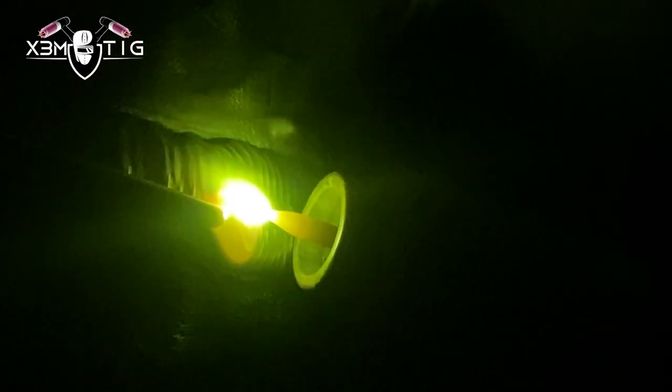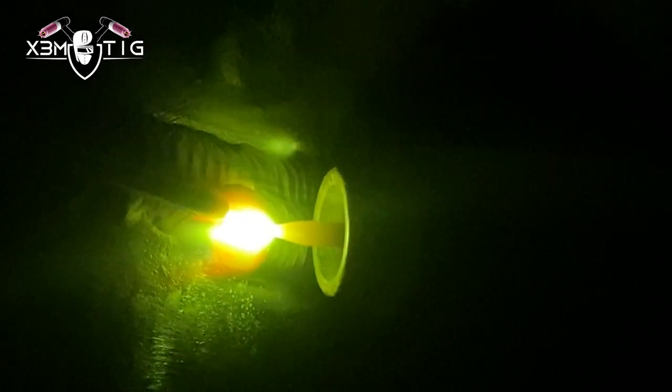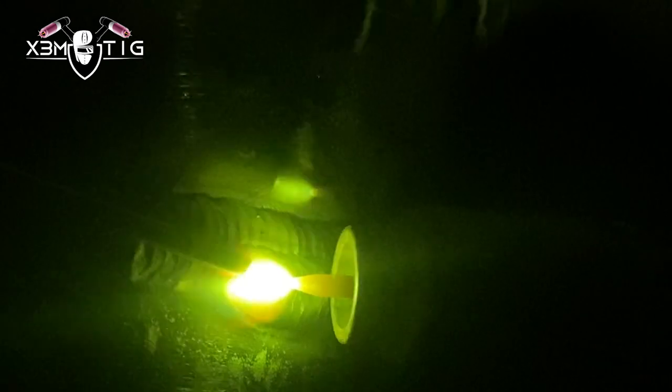Now starting on the second pass — going a little bit heavier on the fitting side. Try to be consistent with your steps and your weld bead width. At this point I'm really sweating a lot, as I'm on my knees the entire time during this weld. As mentioned earlier, there's no room to even stand up straight, so you've got to be on your knees the whole time.